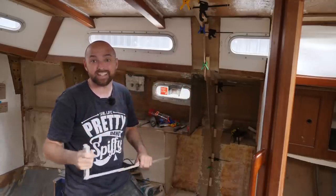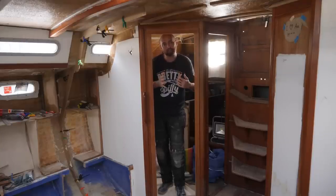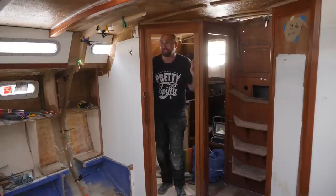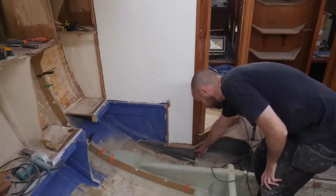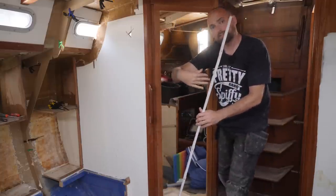I am really excited to see how this is all going to pan out next weekend — I can hardly wait. With all the other big projects I've done aboard Athena, like rebuilding the deck and the osmosis treatment, I get to a point where just seeing the progress being made is a huge motivational factor. Seeing the template for the new bulkhead really did it for me. The plan for the new bulkhead is to tab it to the hull right around here, just as with the old bulkhead — and to join it with the piece of plywood sitting here I'm going to curve a piece and do a nice big radius corner, nice and round unlike the old boring flat one.